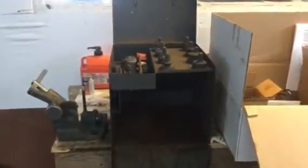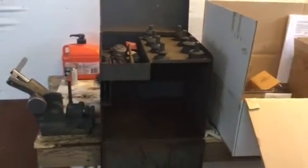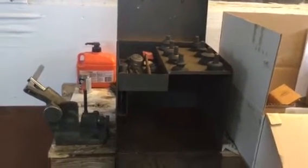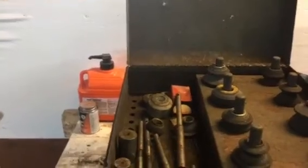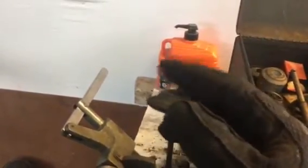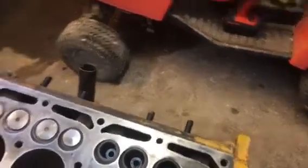This is my old valve seat grinding set. If you go into a modern machine shop and watch the machinists grinding the valve seats, this is not what you'll see. This is 1950s vintage tools. We've got a variety of stones here and different pilots to go in to center the arbors in the valve guides. This is the tool that I use to keep the stones true with the correct angles on them. This engine uses a 45 degree cut on the valve face and the valve seats.